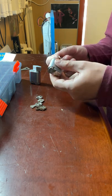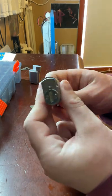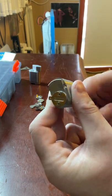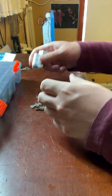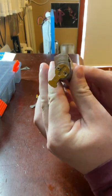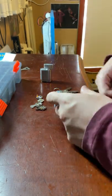To operate the lock, you put the key in and turn it — this drives the cam on the back, which catches the yoke inside the lock to lock and unlock it. The turn snib cylinder works exactly the same way; the cam on the back catches the yoke or the latch to operate it.